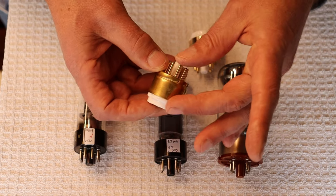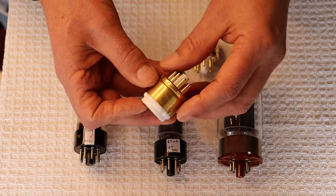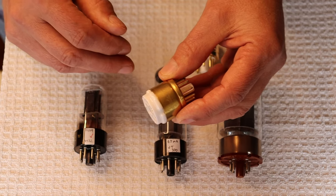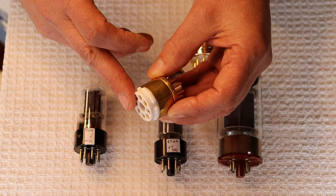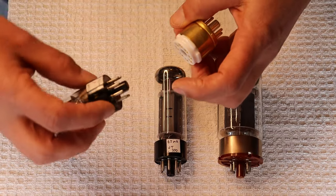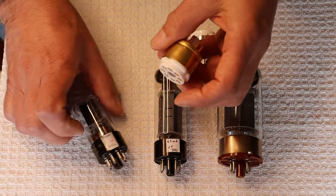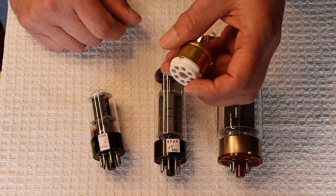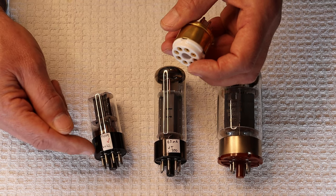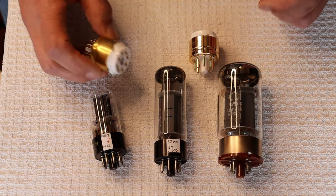More importantly, if you have a sunken socket on your amp — like the Freya preamps or the front end of the R8 — there must be a hundred modern amps where it was convenient and cheaper to build with a sunken PCB-mounted socket rather than building it properly so the sockets are up. Now your tube is plugged in below the chassis, the glass is almost completely sunken, and you need to grab the glass to get the tube out — which is something you should never do with a tube. This is a glue bond, and particularly on older tubes the glue gets more brittle. If you never touch it, it probably will never break — but if you grab it, it probably will.